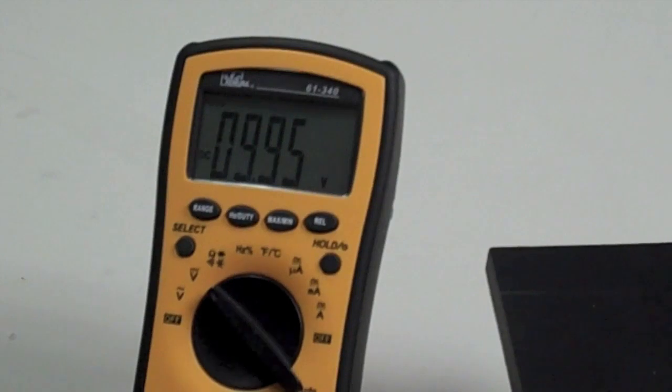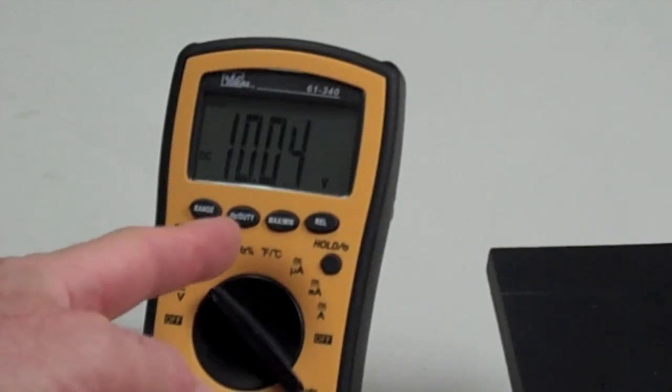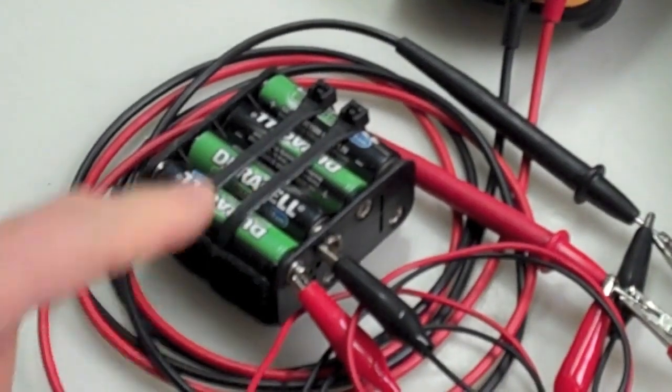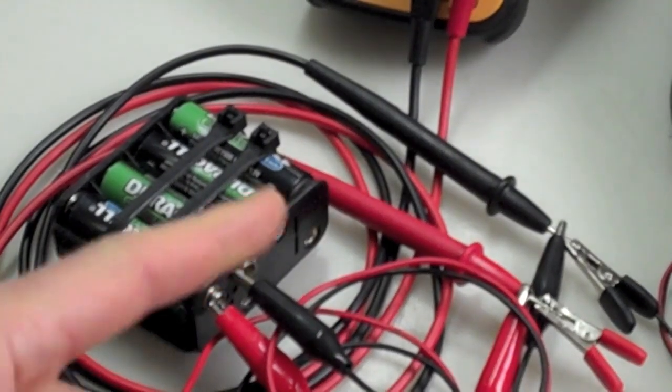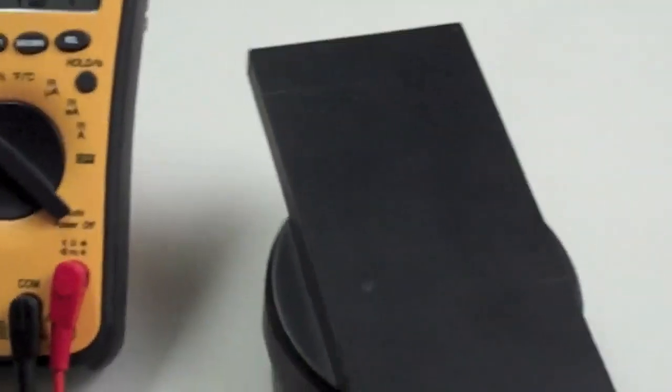So just let it sit overnight, and that one battery that's charged up in there will drain down. This may go up to 11 volts. It's not going to hurt anything for this pack that normally hangs in there between 9.6 and 10 volts. It'll charge it up to or close to a full charge, like I said, depending on how much you've drained the pack itself. So it'll top it off, and then you're ready for the next day.